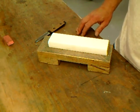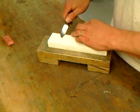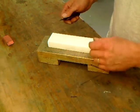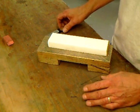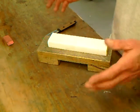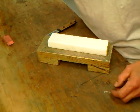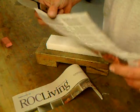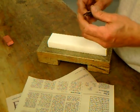You can manage the pressure to create the edge you want. Burnishing is a final step in cleaning if you want to keep the edge as fine and uniform as possible. I did a test using chromium oxide the other night on a couple sheets of paper to try to get the finest edge I could — and it did turn out pretty uniform and pretty fine. Maybe not as good as you could get off of a fine hone going to a leather strop and then to a horse hide, but as far as a real quick, well-refined user's edge, you'll get there no problem. And you can maintain it — that's across the grain. This knife is a real nice slicer, and performance is going to be really good. It's still three-fingers sticky.